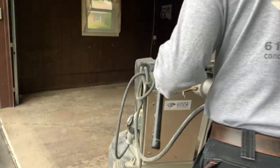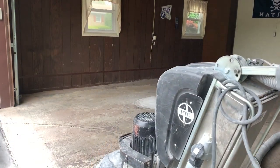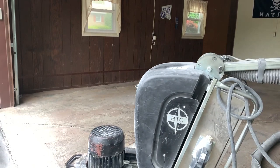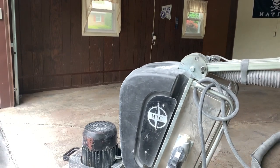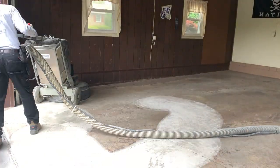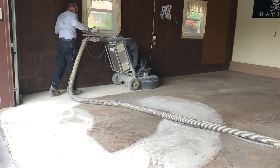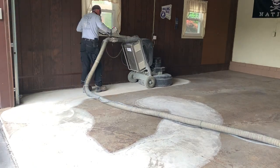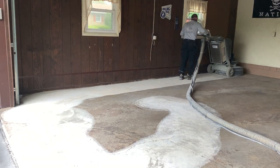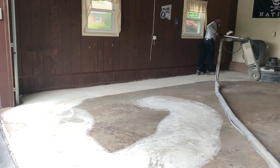You can see a little bit of turbulence when Jeff runs over these cracks for the first time. The concrete was offset a little bit, so we're trying to smooth everything out with the grinder. Then we have to come back and repair those cracks anyway — so this was the right choice. These diamonds are cutting pretty well. It's still a fairly slow grind. We're trying to level everything out as we go, just to give a nice smooth floor for the finished product so you don't see any of the elevation drops over those cracks.